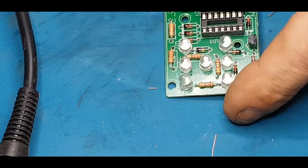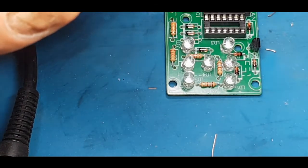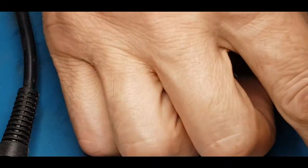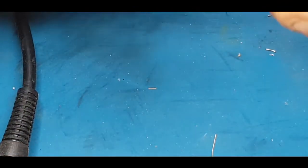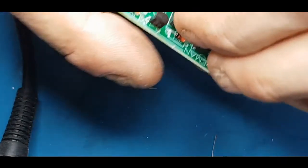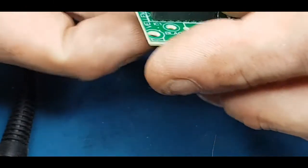The big chip is an 85COE TKE4, which is a CD4046BE, and the bottom chip is a CD4024BE. What I like to do to get these seated is to gently roll them on a flat surface just to get the legs into line, then notch to notch and slide that puppy home.